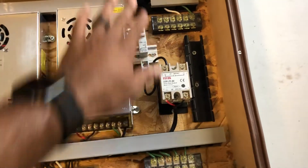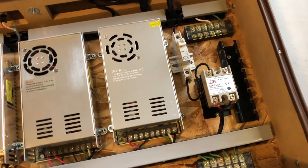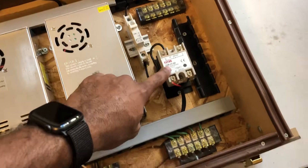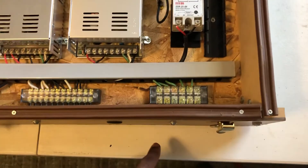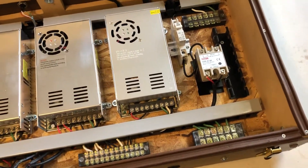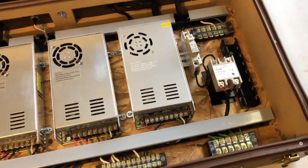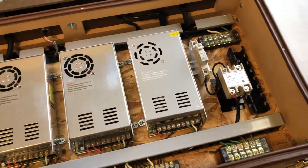This one is going to be the separate circuit coming in from the top of the box, which is going to go to my VFD or spindle. The power is going to come in here, hit this circuit breaker, and then go through this relay, which will only allow the power to flow out the bottom of the box to the spindle — once this power supply is on or recognized and flips this switch on. Like I always say: novice, first project, second first baby — excited about it, and I may overdo and overthink some things.